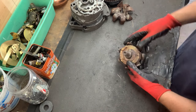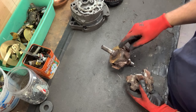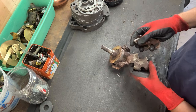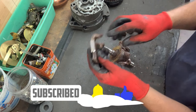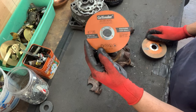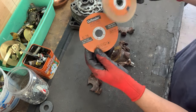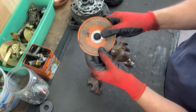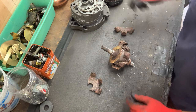Thanks. I got this cut off. I was hoping to cut this shaft off, but I didn't have the clearance with my angle grinder, so I just had to cut it twice into three pieces — it wasn't that difficult. You can see this is three-eighths of an inch thick. I use these Go Yonder blades — this is not a paid promotion, I just think these are amazing. You can get a 50-pack for around $30 after tax, so it comes out to $0.60 each. Just take your time and you won't burn up your discs.